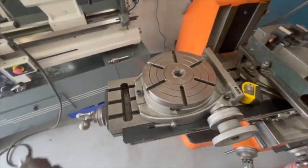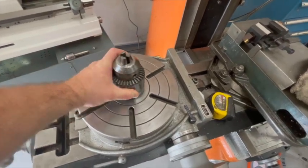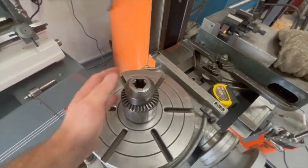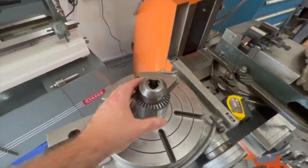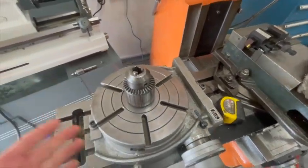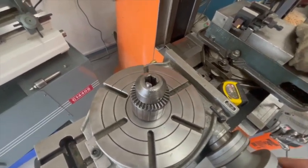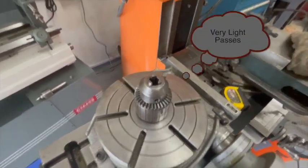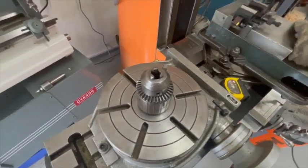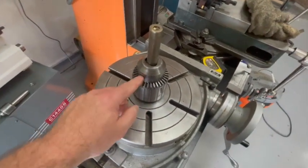Another thing that's convenient is that my rotary table here uses the same size, so I could use pretty good size stock — like if I had something up to three-quarters of an inch, you could stick it in here, stabilize it, and that makes it pretty easy to hold small work. Then I can rotate this table to wherever I want it to go and take a couple of passes on it to create facing or do other things at the milling machine.